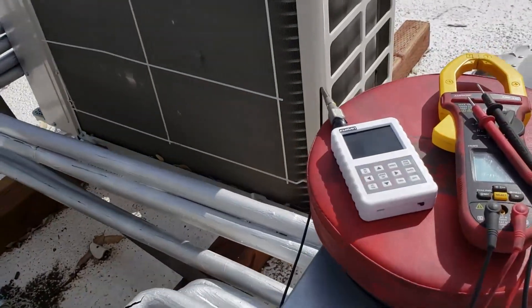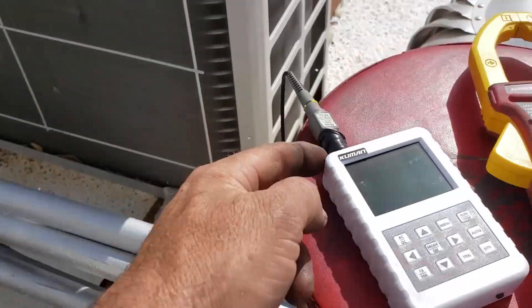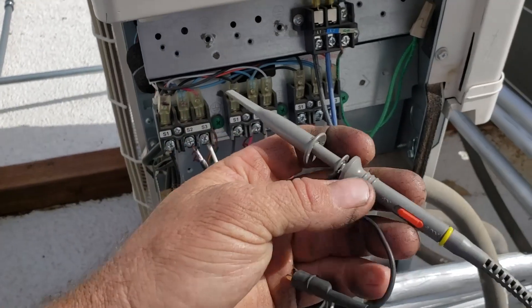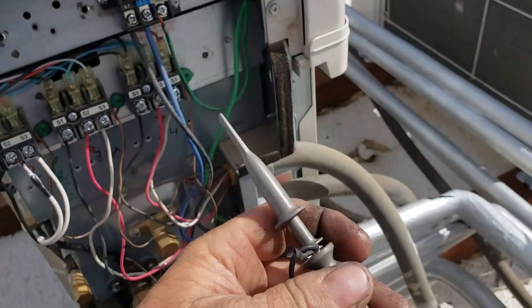So I could get a little better just by figuring this stuff out on my own. Just like I figured out I better put electrical tape on this, because all potentials are high voltage here — it'll short if you let it touch. Just gotta make sure you put the probe on 10x to divide by 10, otherwise you'll send high voltage into these things and blow them.